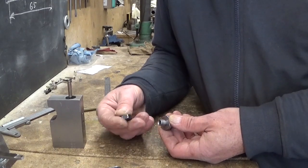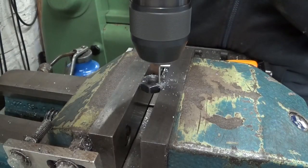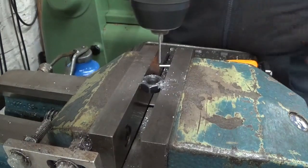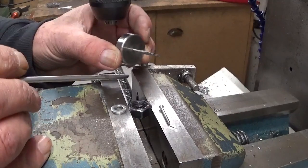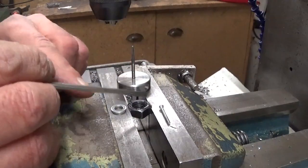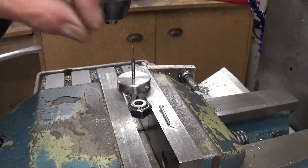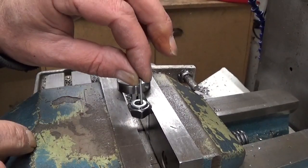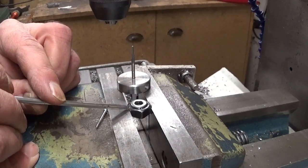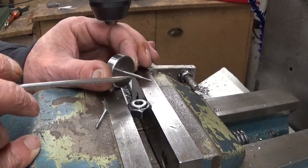Let's try to find some creative solution here. My idea was to drill and tap with my cute little 2mm tap here — tap three holes, and then put this washer here in the center, held down with three little bolts. That's the idea. But this nut is a bit harder than I like it to be, so I'm a bit afraid that I'm going to break my beautiful cute little taps here.